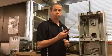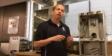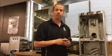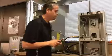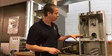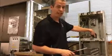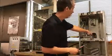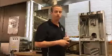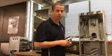You're going to need a lighter, preferably a barbecue lighter like this works great because you have a longer reach, and matches are not very desirable because they burn out quickly and you might need to use this for an extended period of time. Okay, so most applications are going to be the same process. We have our gas valve right here, which supplies our pilot light or pilot gas right through this small tube, and right inside it attaches or is going to be right beside the thermocouple. The thermocouple is what's going to generate our small amount of voltage to engage our system.